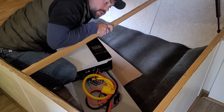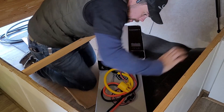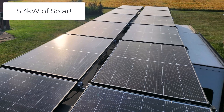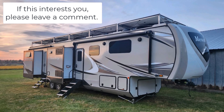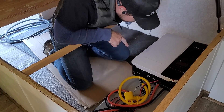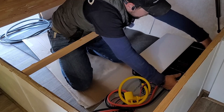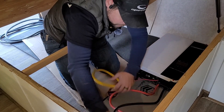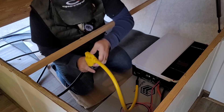Well, it worked out pretty well. I first took my RV off-grid — boondockable, whatever you want to call it — over two years ago, and we've never once needed shore power, which is pretty awesome. There's actually a brand new way of putting solar panels on the roof which far exceeds what I could have done before — much, much better. If you're interested in that, I'll have other videos out or you can email me. So I've got it into position. You're supposed to have about 12 inches of clearance all the way around it, and I have vents on this side and up here. My battery cables are already done — I'll route them right there — and I've got my solar cable and my shore power cable. So that is in and we're ready to turn on.